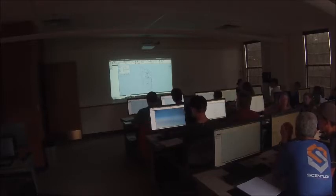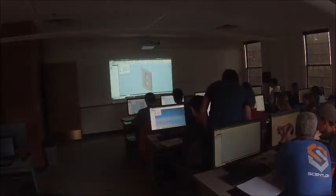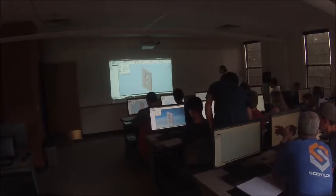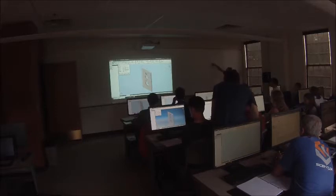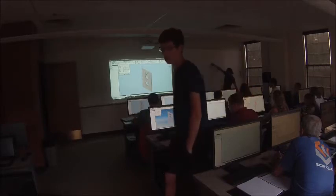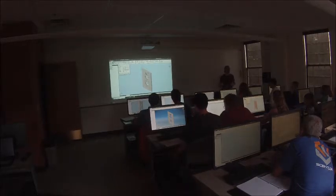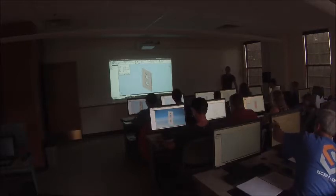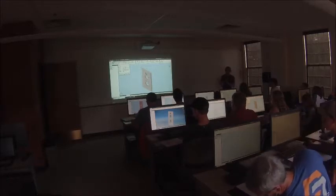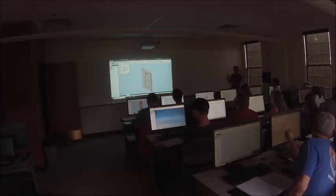Now extrude it. This outer region, quarter of an inch, 0.25. Now, there's a couple reasons for that. First of all, we're going to make this out of aluminum, or we would, and quarter inch aluminum is pretty strong. And this part of the bearing from here to here is a quarter of an inch. And typically for robustness and for proper support of the bearing, you want to support the full width of the outer diameter of the bearing. So we're going to use a quarter inch thick plate with a hole in it, so the plate will end right at the back of the bearing and the flange will be at the front of the bearing, right? So it'll just perfectly fit in the plate.